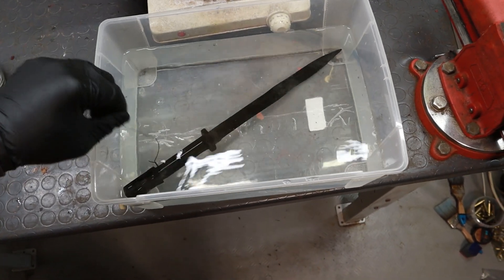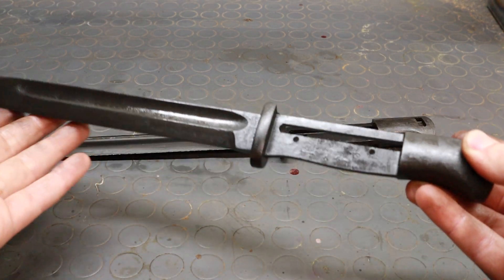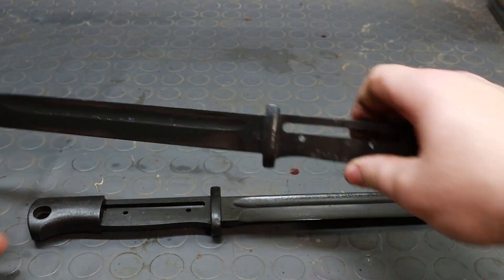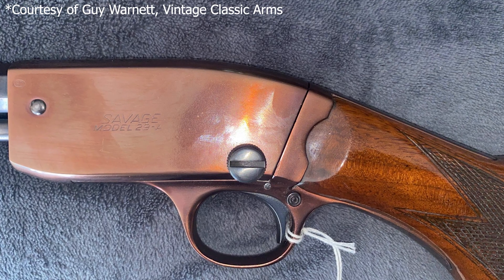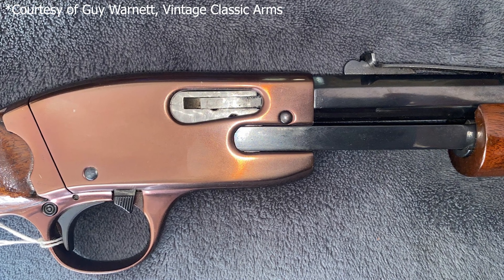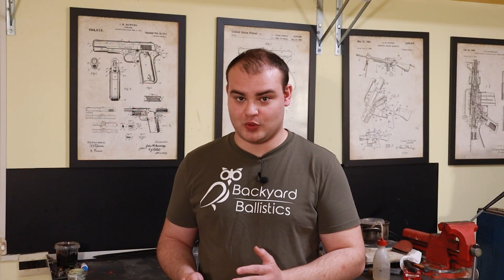This is the result after I've rinsed, dried and oiled those bayonets. If after following all these directions you're still having trouble on some specific parts, it's probably because of the type of steel — some will just reach an orange to purplish colour and won't go any darker. There are a lot of examples of factory guns where some components look like that. If you want black at all costs, you can take over with a few rust-bluing passes.